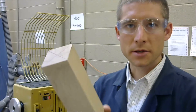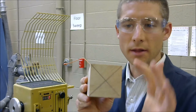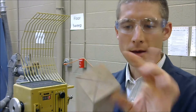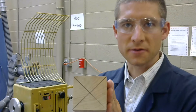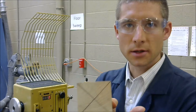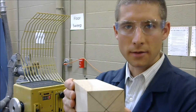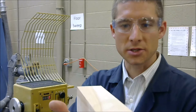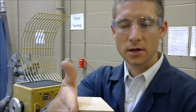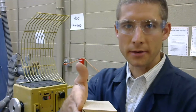Before turning a part on the lathe, it is critical that you first square up the piece, so we need the width and the thickness to be the same. To do that, you want to joint one edge, put that edge against the fence, joint the edge adjacent to it, making them 90 degrees, and then on the table saw, rip parallel edges. So you'll have a jointed edge down, jointed edge against the fence, rip this side, and then you can rotate 90 and rip the other edge.